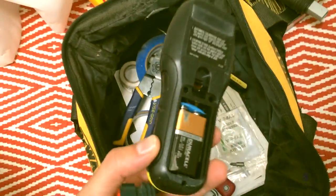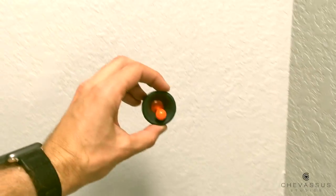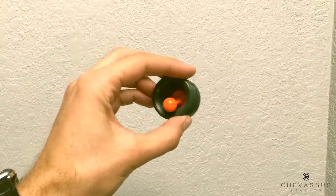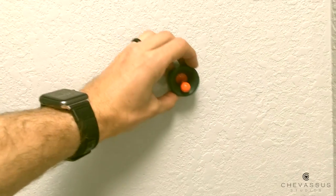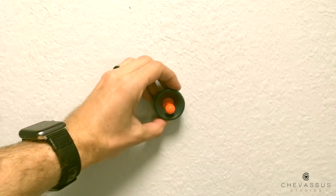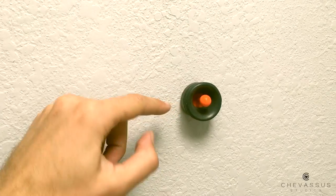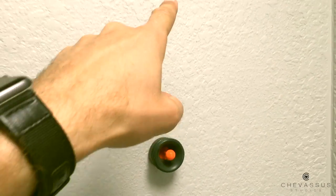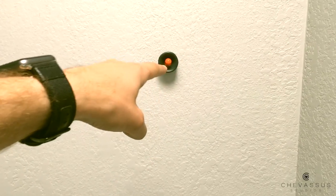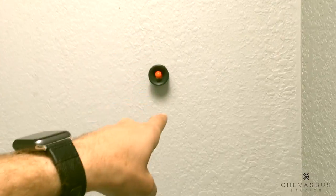Lastly, a little hint, tip, trick. You'll see that this little stud finder right here you can use to find studs, but I would much rather have this little stud finder — this is called a Stud Pop. This video is not sponsored by Stud Pop. Clever name. As you're floating this along the wall, there's a little magnet, and the magnet attracts the little drywall screws — so you know exactly where the stud is because the little magnet corresponds with the drywall screw, which is in the stud.